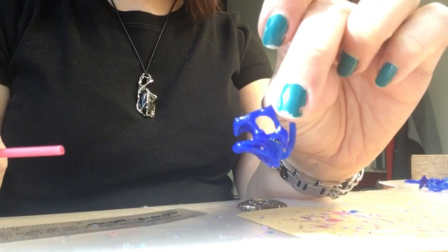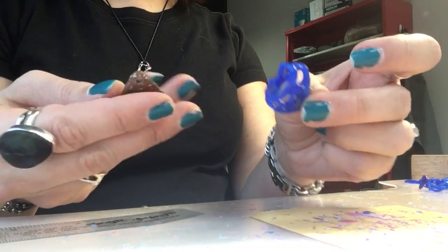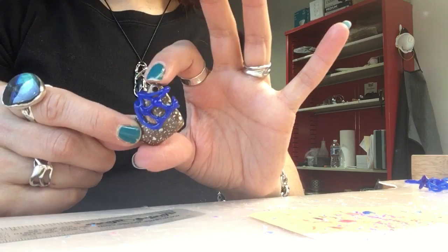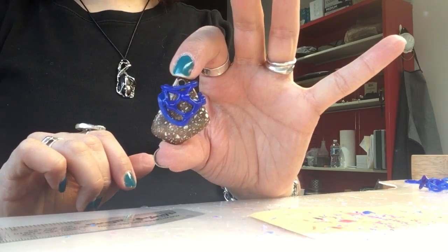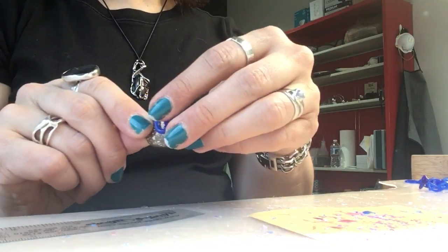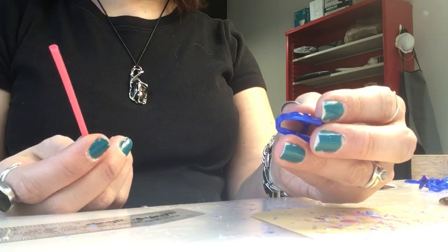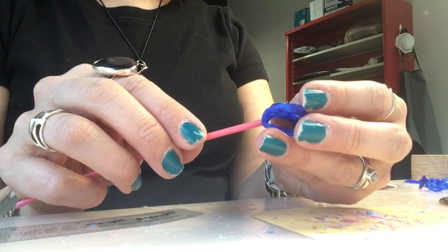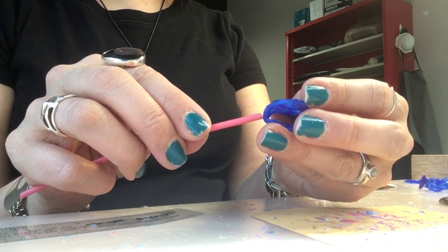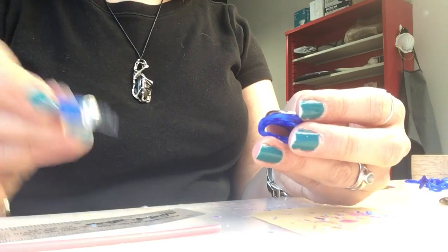Here I have my piece and I'm going to sprue this for casting. This piece will eventually go over this copper brick stone, and then we'll be casting it. So for now I'll take the stone away. Here's my sprue wax, and I'm going to measure two pieces to fit here and here — that's where we'll begin.